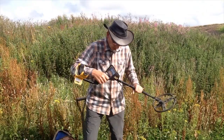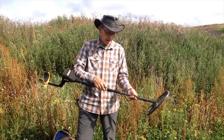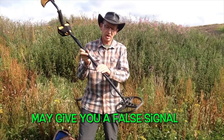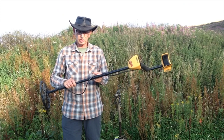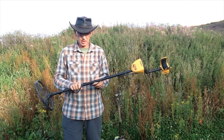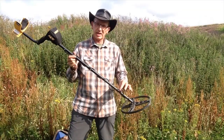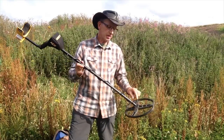Another thing is when you've actually set up your metal detector and you're putting it together, you may find that your cable is lying slack. This is not good because when you're detecting on the ground it will be swinging about and it may cause false signals. To tighten the cable is quite easy — just press the two studs and spin the bottom section. My cable is quite tight but there's enough slack to reach the battery box and the coil connector.